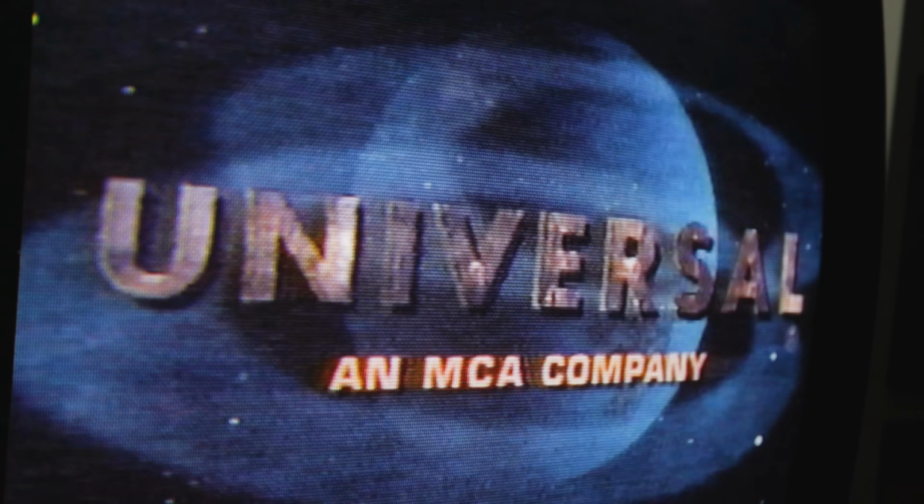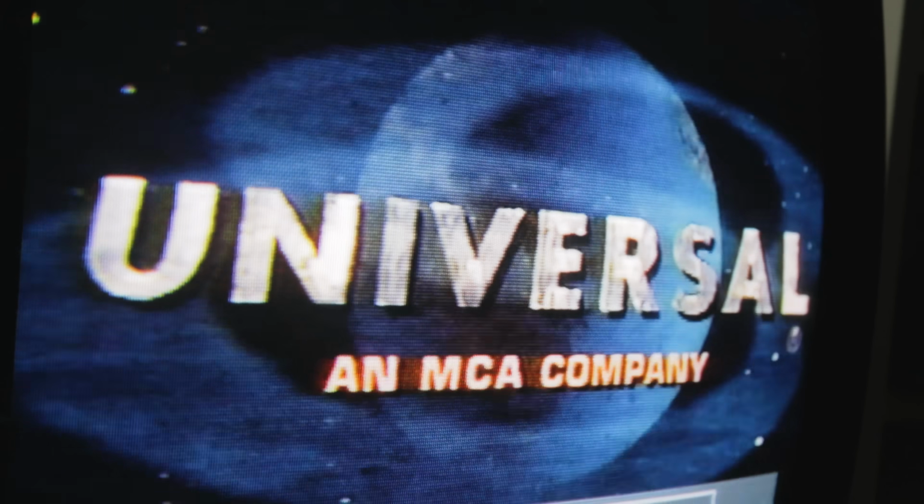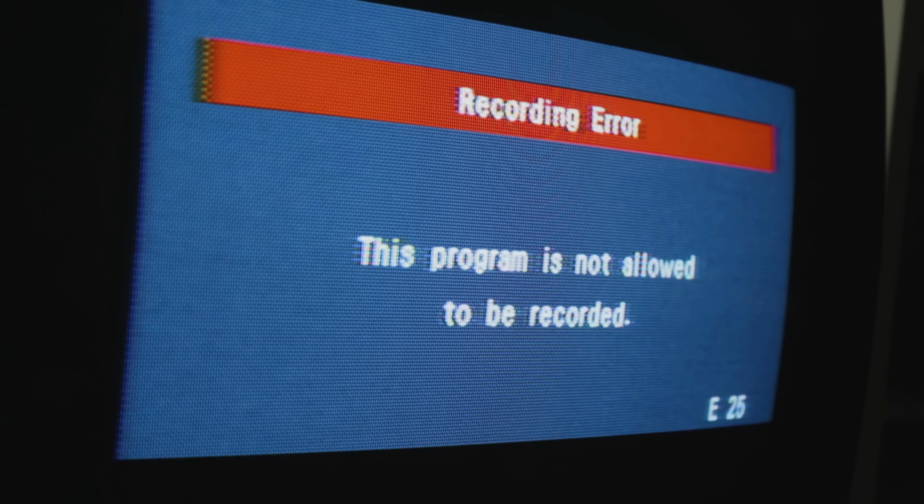Sadly, this won't convert copy-protected tapes. It can tell when something like Macrovision is being used. Macrovision is a type of analog copy protection that puts pulses of light and other weird things in the vertical blanking interval that mess with the VCR when it's trying to copy it. I guess some part of the circuitry is literally just meant to detect that and prevent you from recording.